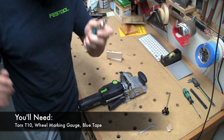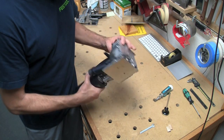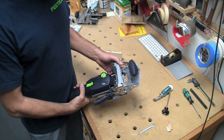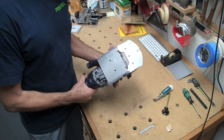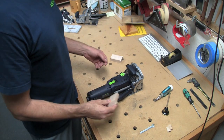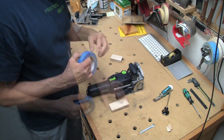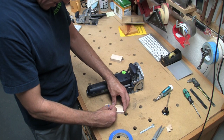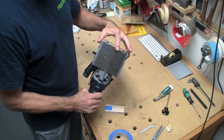If you don't have a Torx T10, pause the recording, jump in your car, go down to the big box store and pick one up. You're not going to want to muscle that with anything but the T10. Since we know that this bottom line is calibrated, we can use this line to set the initial placement of the cursor and then fine-tune it. The fine-tuning isn't correcting any error on this line — it's correcting our positioning of that cursor initially, but you usually get it pretty close on the get-go. This is a bit of a trick: use a little bit of blue tape to initially set up the configuration, transferring a position from the bottom of the Domino up to where the cursor is.